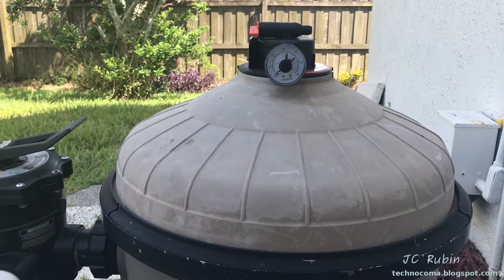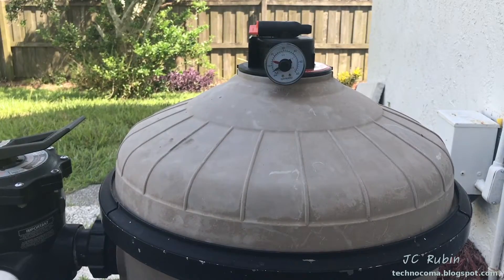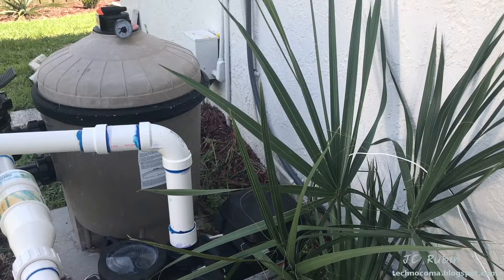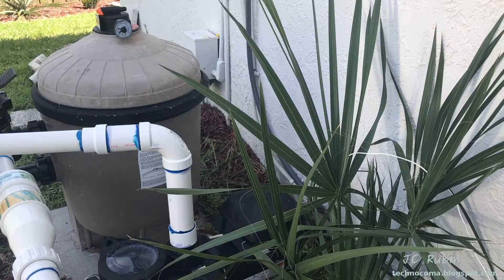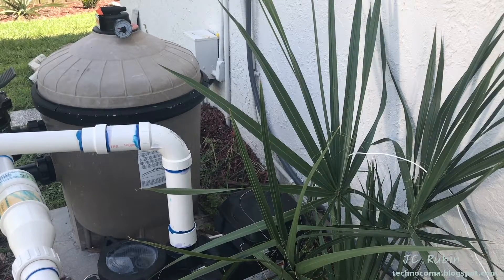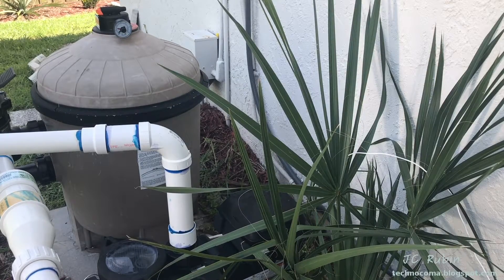We are still seeing 7 PSI at 3250, 4 PSI at 2500, 2 PSI at 1750, and unreadable at 1000. They haven't changed. Everything seems good and that's going to be my baseline. I'll bring it up to the normal operating speed, set the knob, and we're done. I hope you found this video on the comprehensive maintenance of this Hayward DE filter system informative, entertaining, and useful. Thanks for watching.